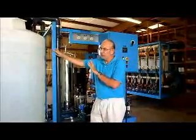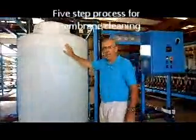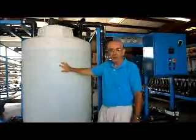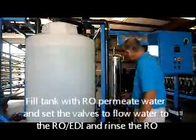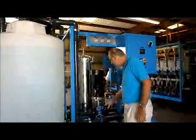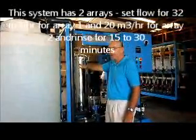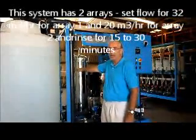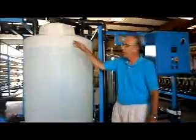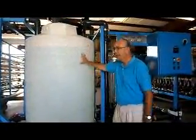For cleaning the RO, we recommend a five-step process. First step: fill the tank with pure permeate water and do a rinse on the RO membrane. You wouldn't have to do any mixing — just adjust the flow valve to get the flow you want. For array one of the RO, set 32 cubic meters per hour and just rinse, running the permeate water through the RO membrane back into the tank.